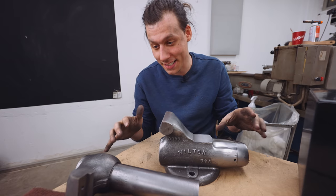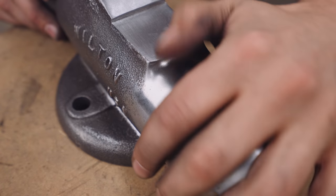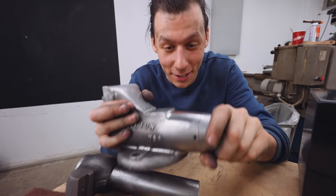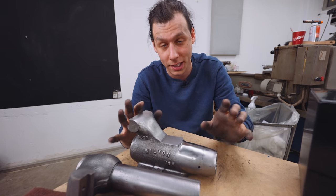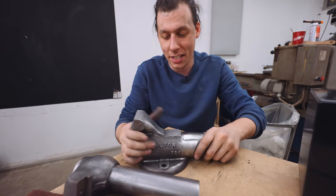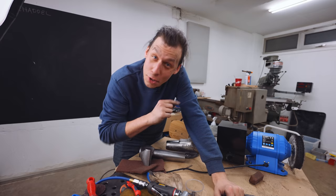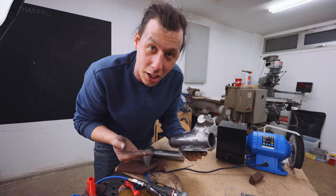I know I'm dirty, but hear me out. I've been grinding away on this thing for a couple of hours and I'm really pleased with the way it's turning out — getting this really smooth surface finish which I really like. Initially I was planning on painting it — applying some Bondo, body filler, sand everything smooth, and then paint. But I just love the way this is looking right now, so I'm going to try and finish the whole thing with a satin finish instead. That's a whole lot more work than painting, since sanding cast iron is a lot harder than Bondo, but I think it's worth it. The only issue is these cast-in letters — I've spent over an hour trying to make them look nice and it's just not going to work. My solution is to just get rid of the letters entirely, because the function of the vise remains the same and I don't really care if it says Wilton on it.